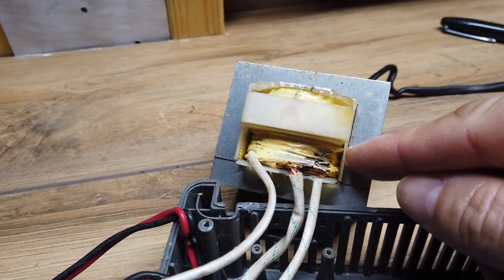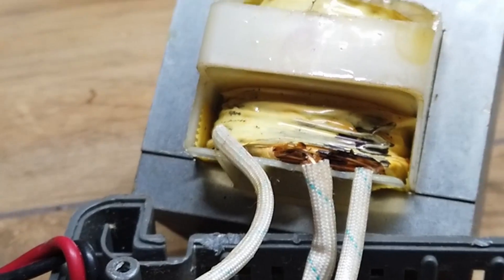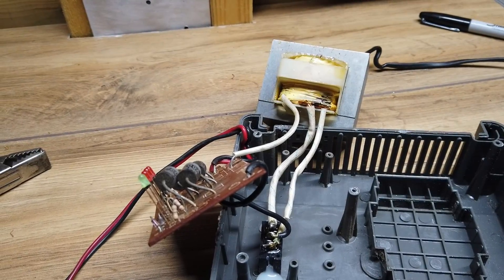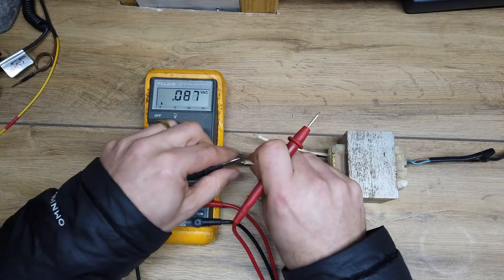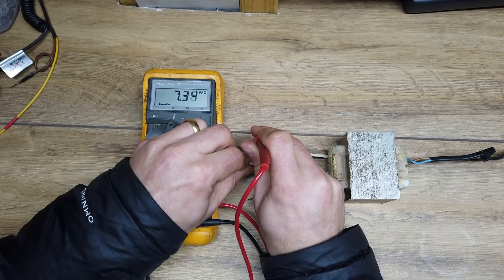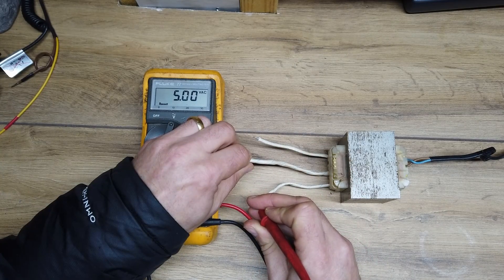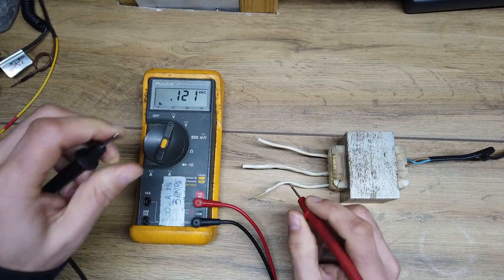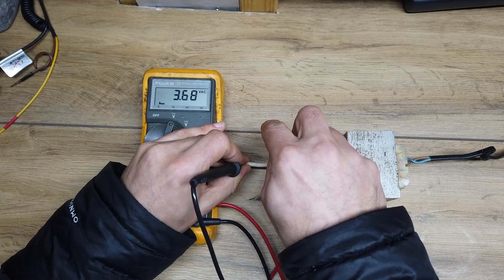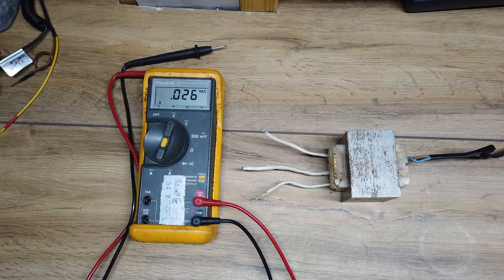On the right-hand side of the transformer, you can just about see a little bit of black. If you look down inside the windings, there's some enamel copper wire in there, and I'm thinking that perhaps a couple of those wires have gotten a little bit warm, the enamel has worn, and the transformer has shorted a few coils. Checking the voltage: we've got 7.35 volts AC on one coil and 5 volts on another. This transformer just hasn't got enough volts — this is definitely the problem right here.